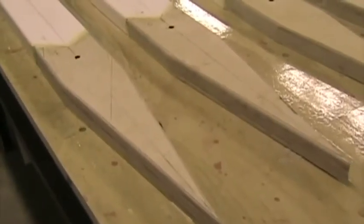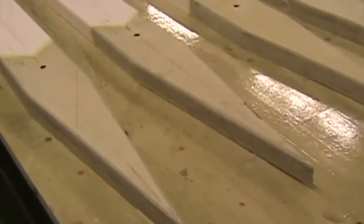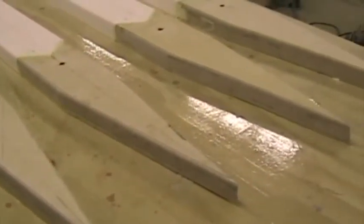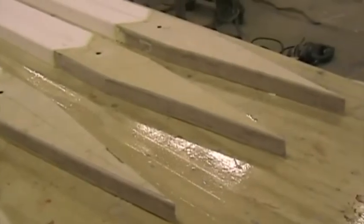The plywood inserts have been trimmed. We laminated them and trimmed them and tacked them to the table surface using micro. And we've also bonded them to the foam using micro balloons, which you can see there. There's no need to use cotton flock for this bond because you're just bonding plywood to foam and the micro balloon is adequate. The edge of the plywood we've also radiused to allow the glass to drape nicely over there.